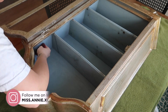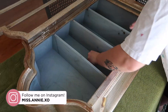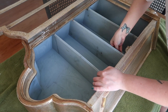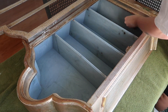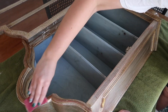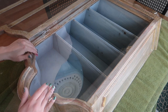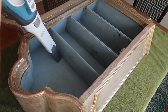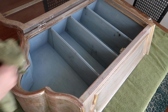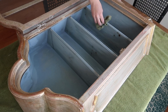I'm starting off by giving it a little bit of a sanding. I'm not going crazy on it, but I am all about putting at least a little bit of prep work in when it comes to refinishing furniture. I have 150 grit and I'm going over all the surfaces just trying to smooth it out as best as possible. After sanding, I'm making sure I get all that dust cleared up using my vacuum and just a wet microfiber rag.